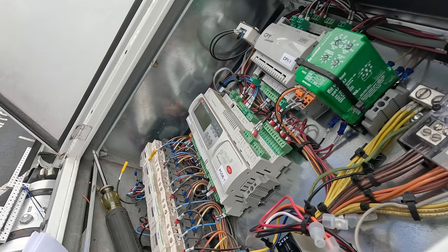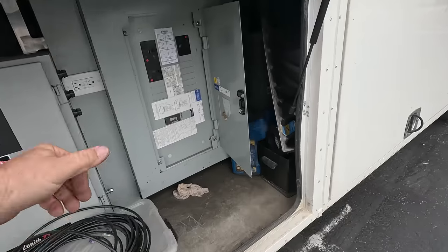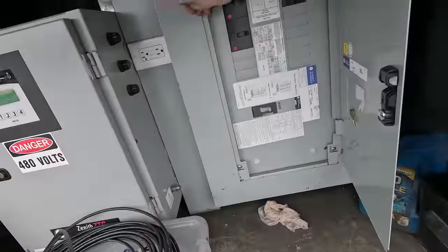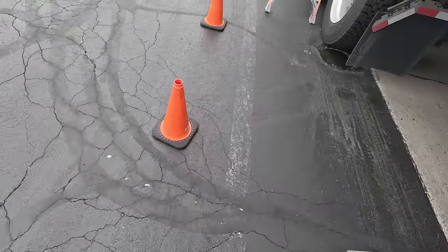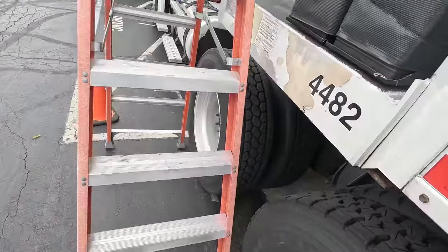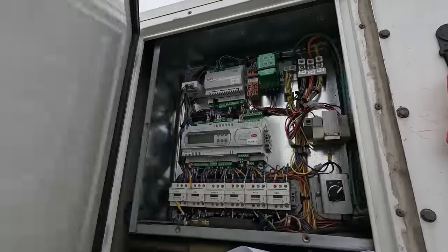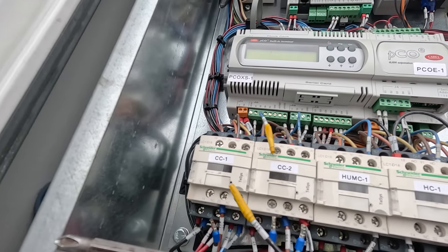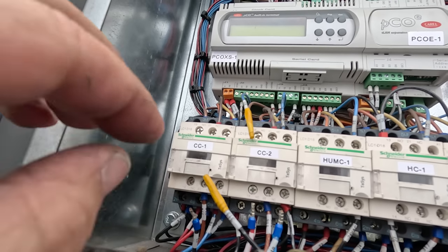Let's go ahead and just turn this thing on and see what happens. Worst I can do is trip the breaker. See if we get a ta-da moment. Not yet. Ooh. Ooh. Yeah, she was doing some funky monkey stuff. That contactor was possibly having an issue. It was rapid cycling that turd. Which makes me think you may actually have issues with something besides just the contactor.